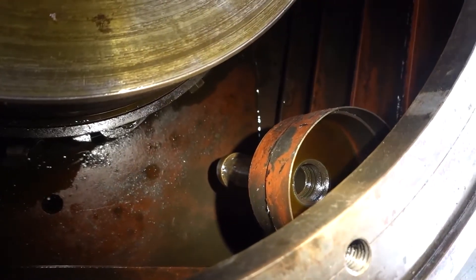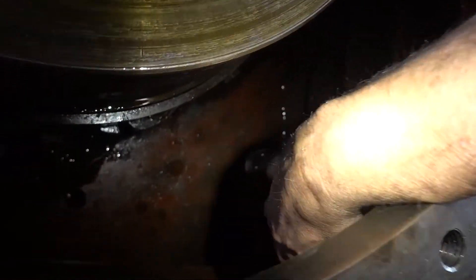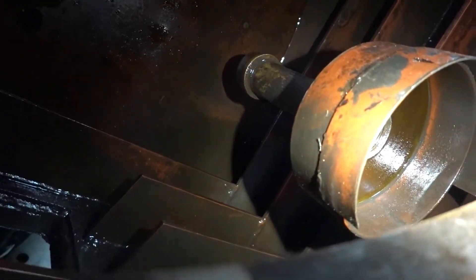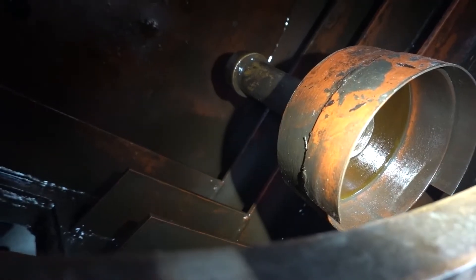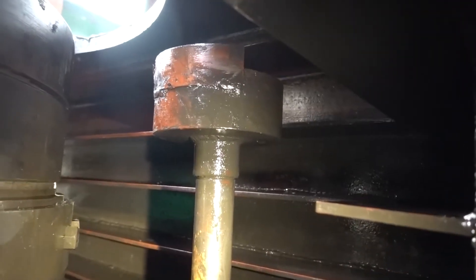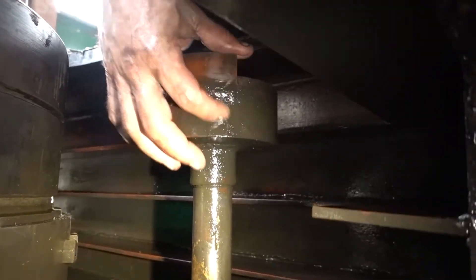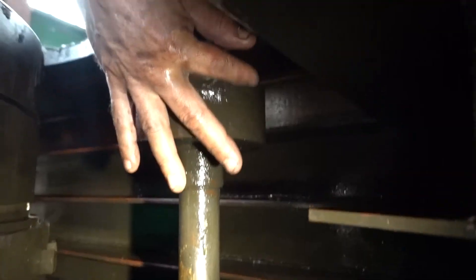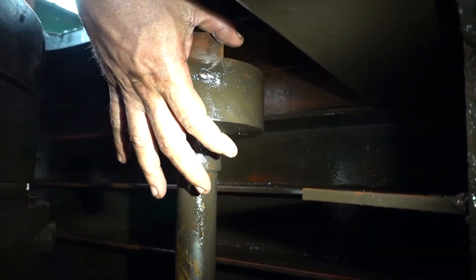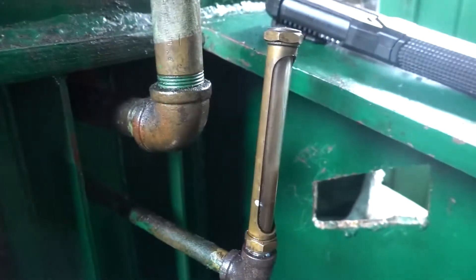So let me show you inside the thrust bearing where the oil level is. There's a can inside the bearing tank — there's the top. If you reach back in here, there's a cutout. The bottom edge of that cutout is your low level. Top of the can is your high level. So you've actually got a pretty narrow range. Your oil level needs to be in between there, and that's sighted on this sight glass right here.